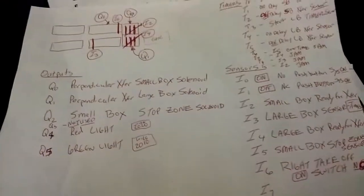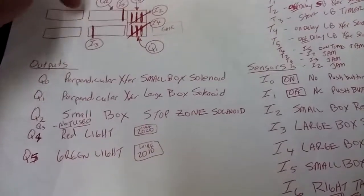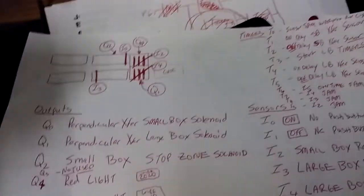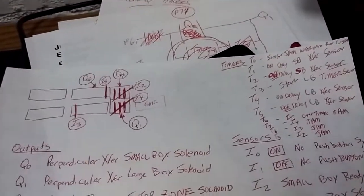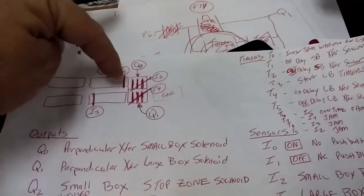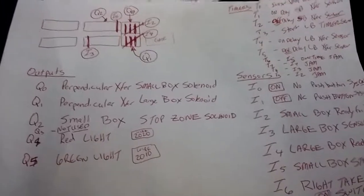Here's the final system drawing. In this crude drawing you can see the small box conveyor and large box conveyor. The large box conveyor is not connected to the traffic cop, but the small box conveyor is. You need a one-horsepower driver for that. The outputs are Q2, Q0, and Q1 - Q1 pushes the large box transfer, Q0 is small box transfer, and Q2 stops the last two and a half feet, though you can tee off for five or seven and a half feet.